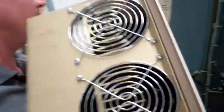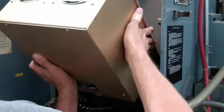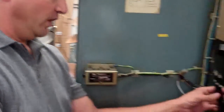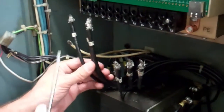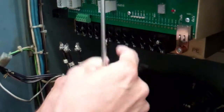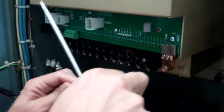Put the drive in and leave these two screws in so you can hold the drive in place. To hook it up, everything should be labeled before you took it out. It should be labeled T1, T2, and T3, and L1, L2, and L3. It's labeled here on the drive as well — T1, T2, T3, and L1, L2, L3. So this is input and this is output. The two resistor wires for the regen usually aren't labeled, and they'll be going into R1 and R2. So you want to clean up the wires before you put them in.